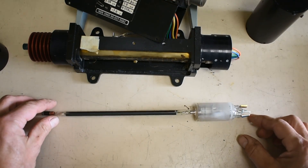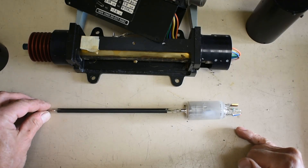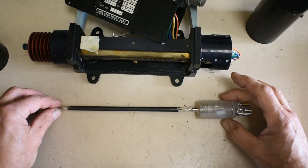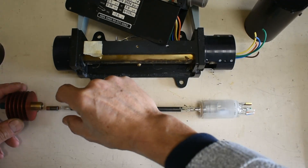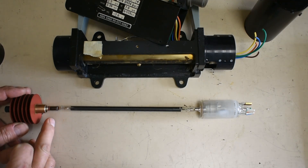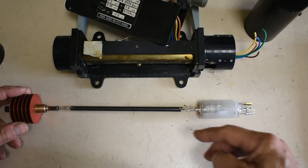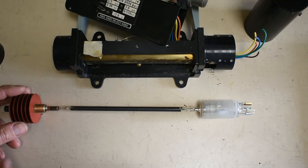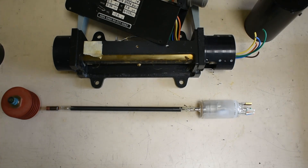You can see this was never really intended to be serviceable — there's not even a socket fitted onto the actual travelling wave tube itself. You can see where this heat sink was attached to the anode, because the impact of the electrons would generate some heat. The voltage is only 2.7 kV so it wouldn't produce x-rays, but travelling wave tubes running at 50 kilovolts and the likes will produce x-rays as well.